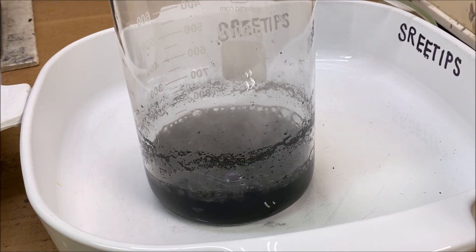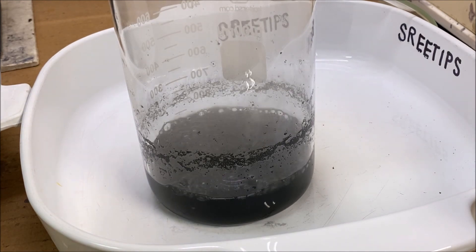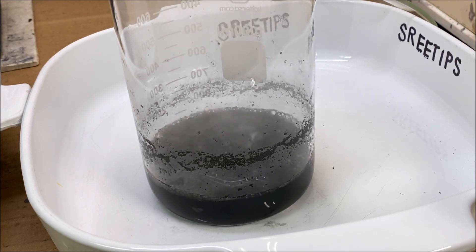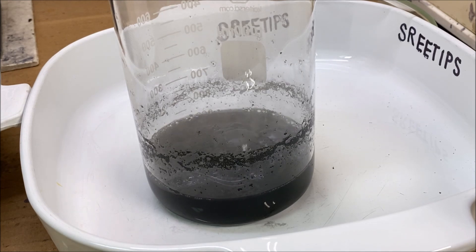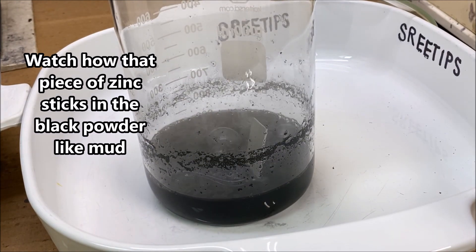This reaction has been going for about two and a half minutes. The reason we use zinc here instead of copper is because zinc reacts much quicker than copper would. We could use copper to get this out of solution, but it's not as good a metal to have in solution with the platinum group metals to cement them out — the copper will go into solution and then you've got a whole bunch of copper in there, and it would take much longer for the cementation reaction to happen. But with pieces of zinc, as you can see, the reaction happens much quicker.